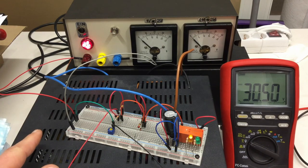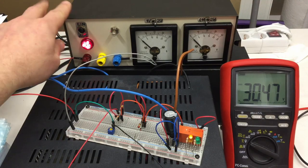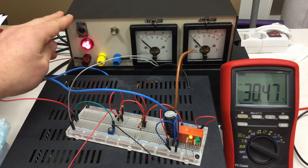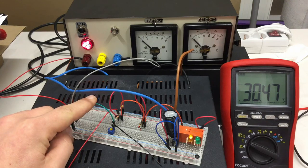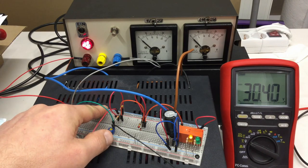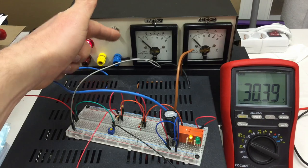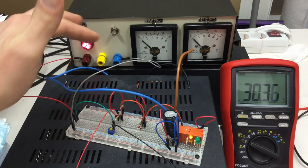So, slightly different perspective. I have here my revamped first ever built power supply, look at that power indicator. I connected that to our ground rail and to our sense line. It's currently at 0 volts. I'm measuring the voltage between our power positive rail and our sense line, which, since I'm putting out 0 volts here, is exactly the voltage at our positive rail.